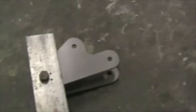Also, to be able to attach the bell crank mechanism, I'm using this aluminium angle backing, which is going to go in first, and then the glass layers are going to go on top of it, and it'll ultimately act as a backing into which we can rivet and attach that bell crank mechanism. The cutout here in the angle is just to allow clearance for the anchor nut.